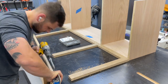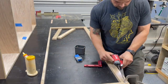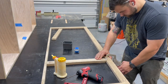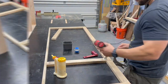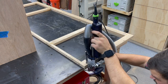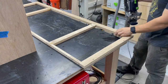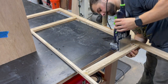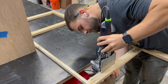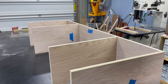I definitely need to get a new bit — this one's pretty dull and kind of fighting me. Then just smearing a little glue on the edge and clamping everything down to the table, which ensures everything is lined up and square, and then running those screws in. To attach the face frame to the cabinet, I'm going to use some four-millimeter dominoes to keep everything lined up during the glue-up. Not adding strength here, but it does take a lot of the stress out of the glue-up. A biscuit joiner is the preferred method but I just don't have one — use what you got, and this works the exact same way.